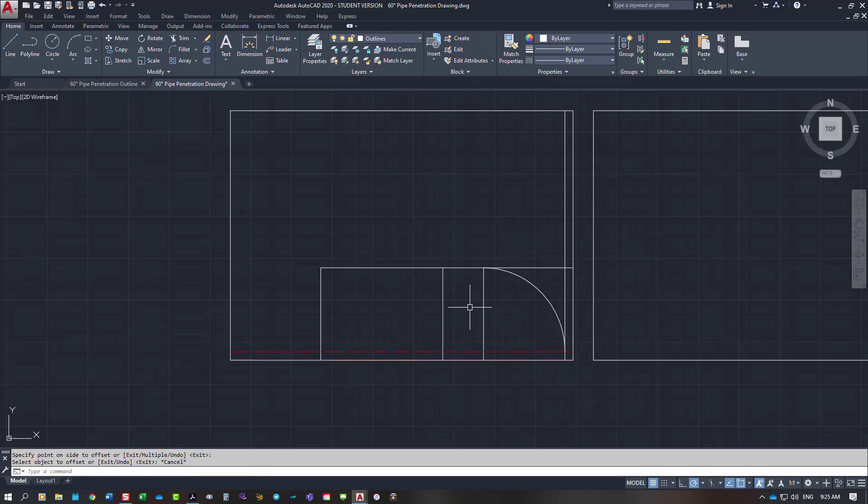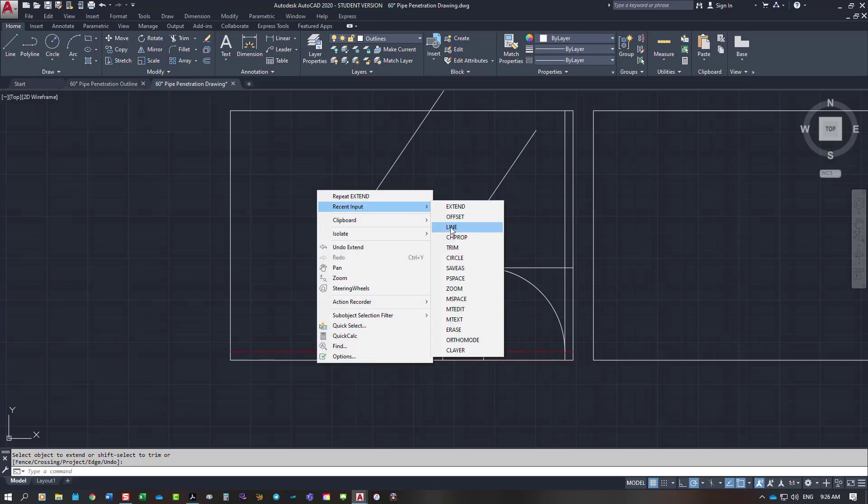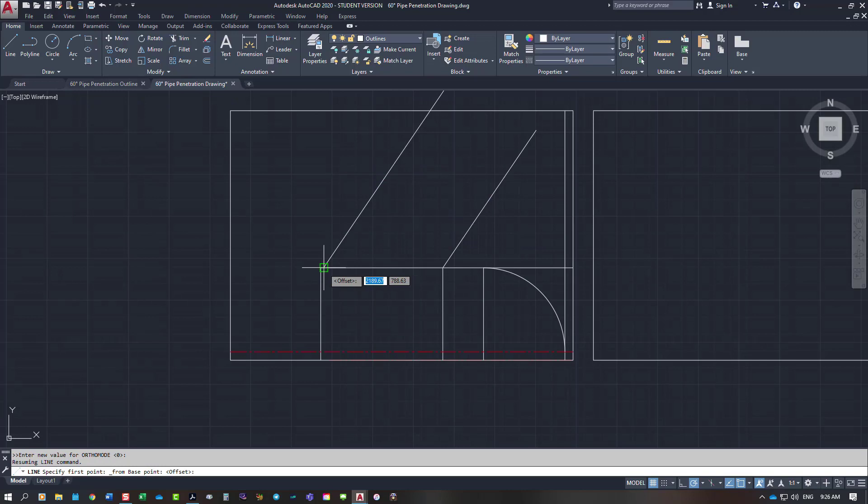That's going to be my start position. I want an angle of 55 degrees, so I'm putting in a line there — 200 millimeters long at 55 degrees. I'm telling it that it's 120 millimeters wide, so I'll offset 120 and extend that line down to the base. It just fits onto the length I've drawn. It's going to be 200 millimeters up this back face, so I need to put in another line from that point up here 200 millimeters, then cut back down and draw a perpendicular to it — there's our pipe.